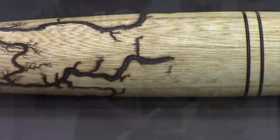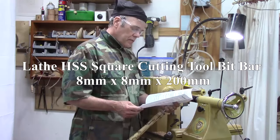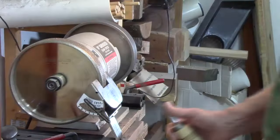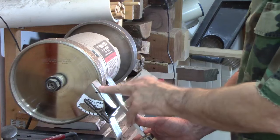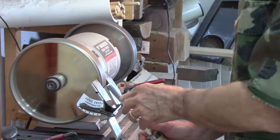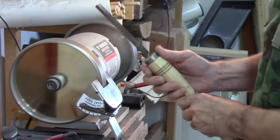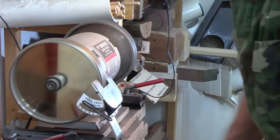I'm going to put the search term up on the screen: it's 'high-speed steel HSS square cutting tool bit bar 8mm by 8mm by 200mm.' That search term should find it on either Amazon or eBay. We're going to grind a 45-degree total included angle — anywhere between 40 and 50 degrees is reasonable. I'm going to use my heavy 80-grit CBN wheel. The grain is running this way and that's the direction I'm going to be sharpening on each side for maximum strength. We're just going to keep this thing moving, dipping it in cooling water periodically — not because the steel really needs it, but because it gets uncomfortable for my hands.